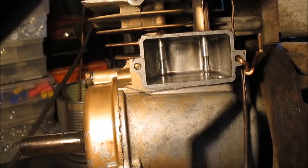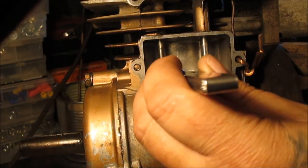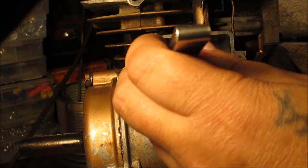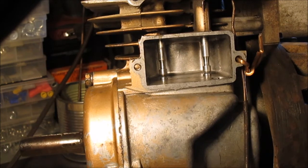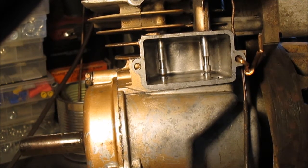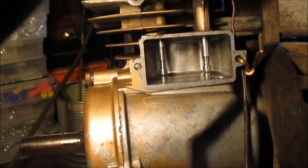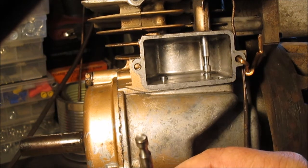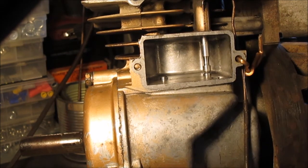We're almost done — we've got to do the exhaust. We've tried zooming in and we just can't get the motor any closer to the camera. There's a 10 — I can hold the valve down and tell you it actually feels a little loose. I can't remember, it was about an 8 or whatever before, and I just took a little bit off just to clean and tip the valve off, so it is kind of a loose 10. This one's okay now, the intake we're done. We will be taking this back apart to put a new gasket in it, so that is the end of this episode. We did try to take a picture of the tip of the valve so you can see that swirl pattern because you're spinning it on the diamond wheel. Thanks for watching.